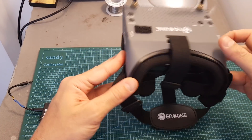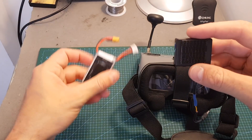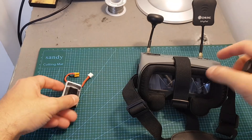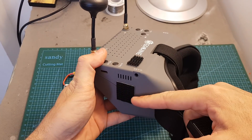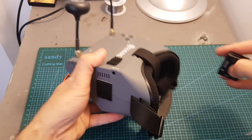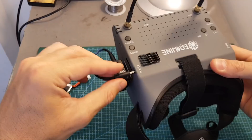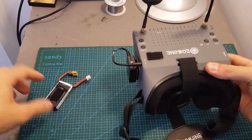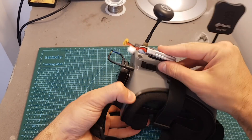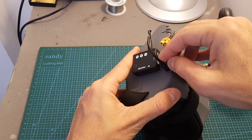The last step is to mount the DVR unit. The easiest way is to use 3M double-sided tape — put some on the DVR unit, some on the battery, and two strips on the sides of the goggles. Be careful not to block the ventilation holes. Place the DVR unit on the side with the 2S balance connector facing up, connect the AV-in cable, then place the battery and power it up using the balance connector.